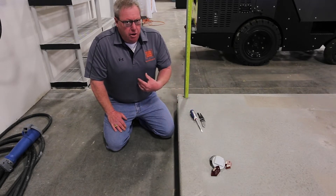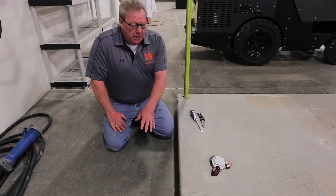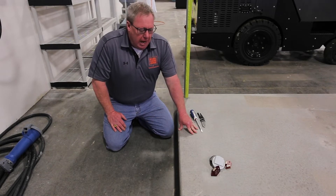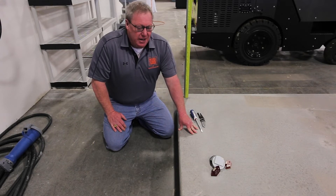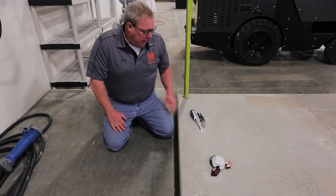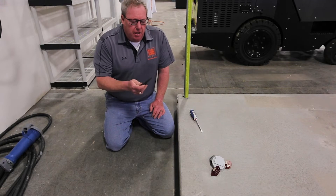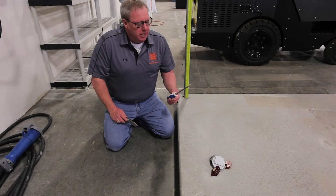The original concrete in this building is super hard — about 6,500 PSI. The concrete we had poured on top of it is very soft, somewhere around 2,000 to 2,500 PSI. I prefer the knife method because I always have a pocket knife on a job site. If not, I'll show you the same way to test with a screwdriver.